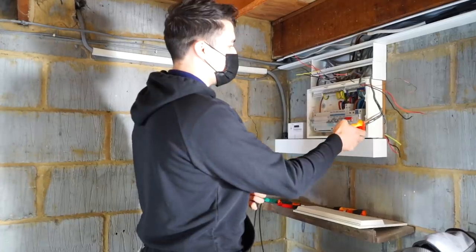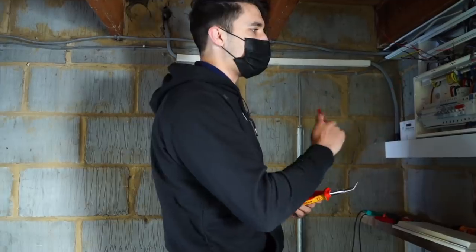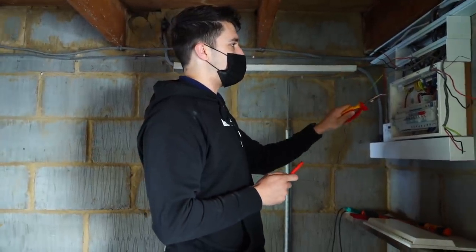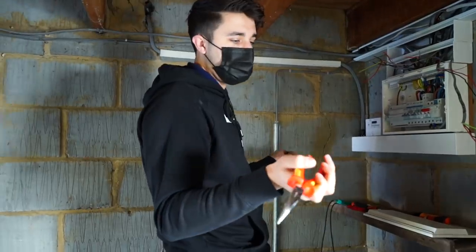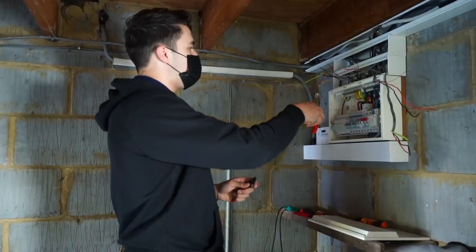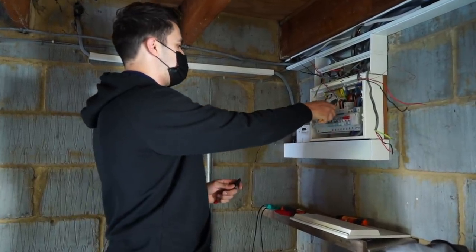So I'm trying to suss out what on earth is going on. You've got all the wall lights coming on, but none of the switches are live. So what I'm doing is I'm just livening up one thing at a time and seeing what comes on and comes live. One of the luxuries of having an empty house is you can do that, because no one's here to get a shock.